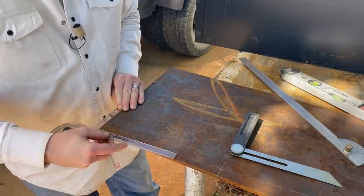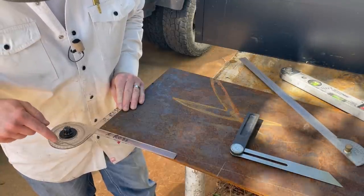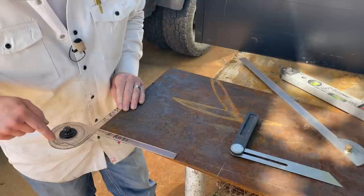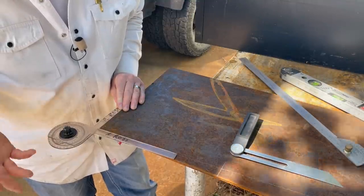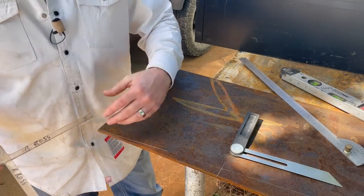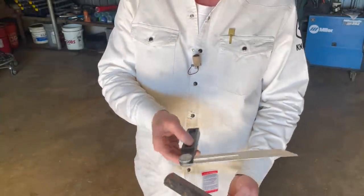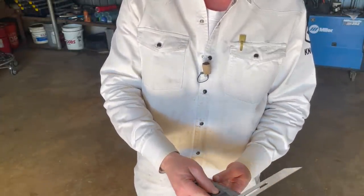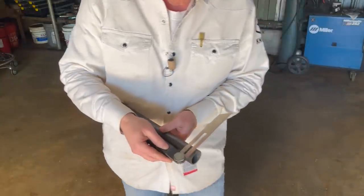So it looks like it's 85 essentially. So we want 40, looks like 42 and a half roughly. 42 and a half roughly is what each miter needs to be. And then you might be asking, okay, how do I take this angle that we figured out and convert it to the actual rail.